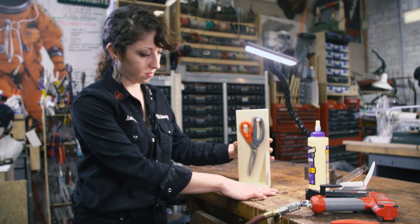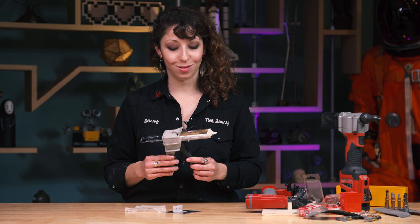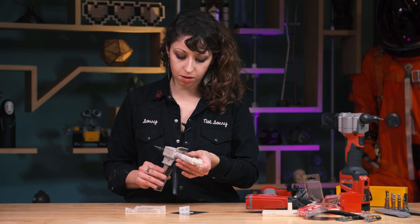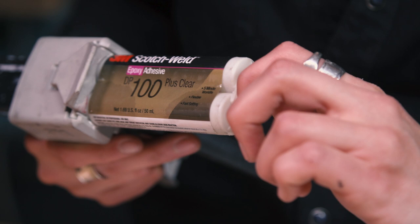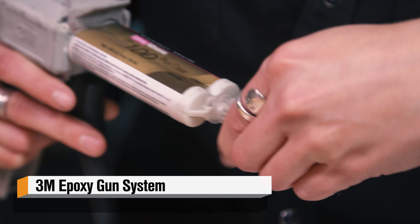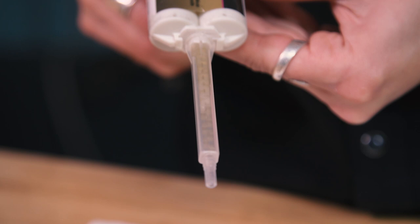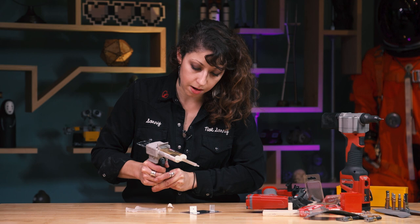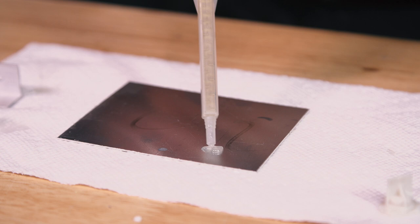The last of my favorite things is a very simple tool. I've definitely used two-part epoxy before, but I'd never encountered this until I saw it in the shop at Adam's. This is a 3M epoxy gun, and it basically just loads your two-part epoxy into the top here. You clamp that down, and then there's a little applicator tip that you can attach to the front. What's awesome about this is it has a pre-mixing system — basically there's a coil that goes through here, and when you pull the trigger, both parts of the epoxy mix in the tip of the applicator in a perfect ratio. They come out of this really fine needle tip, so I can get a nice small dab of epoxy exactly where I want it.